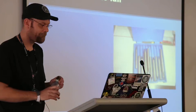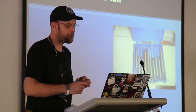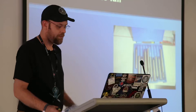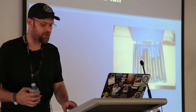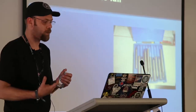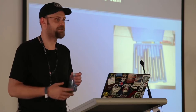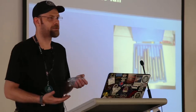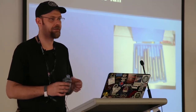Expect to fail. When you're making a cutaway, you'll break a lot of end mills. All those end mills were from one batch of 20 locks and they just failed. When you're buying end mills, cheap isn't good — but the most expensive end mill you can find in the size you want isn't necessary either. We're not working with really tough materials. Brass is fairly soft, aluminum is fairly soft. When you get into the steels, you end up using things like boring bars for mortise cylinders to get that nice swoop like you see on Medeco cutaways.